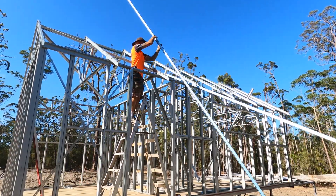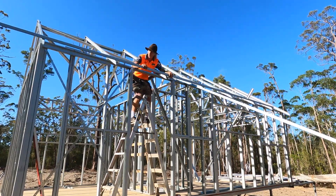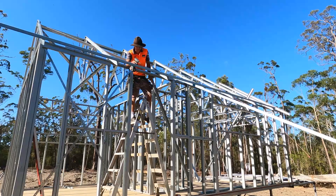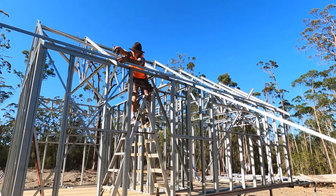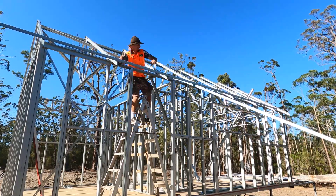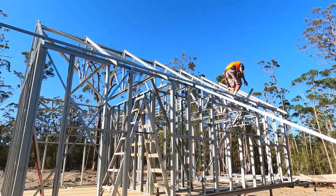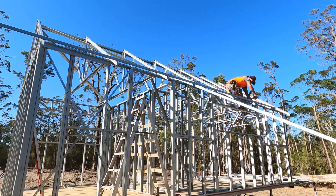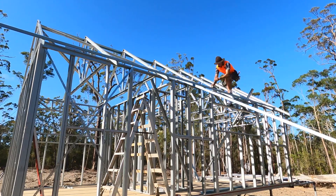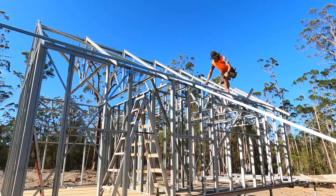Now I'm putting the roof battens up. You can put roof battens up by yourself no dramas because they're so light. A little trick: you can put a screw on the bottom side of the roof batten and let it slide down until it hits the screw — that will stop it from slipping out of your hands. Maximum spacing between roof battens is 1200 for a Colorbond roof. Our roof is less than 2400 long, so we're going to have one batten at the bottom, one at the top — which the ridge cap will also get screwed to — and a centre batten.